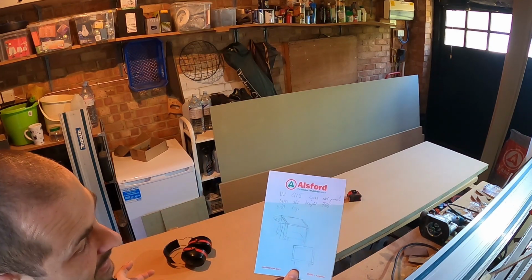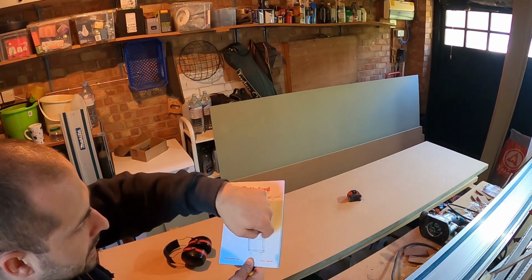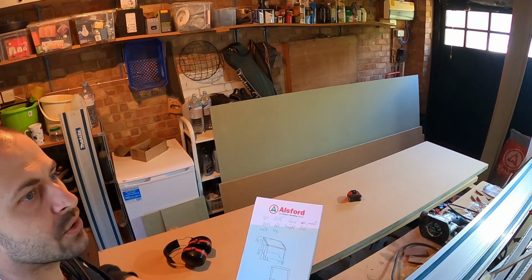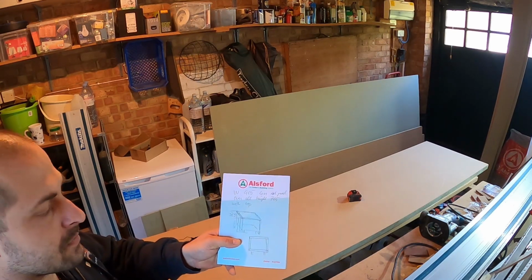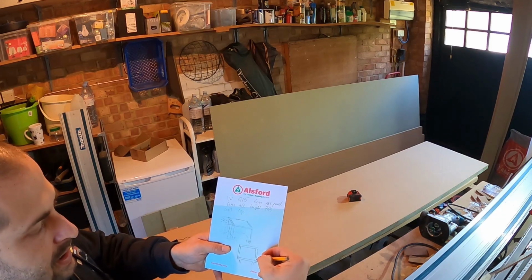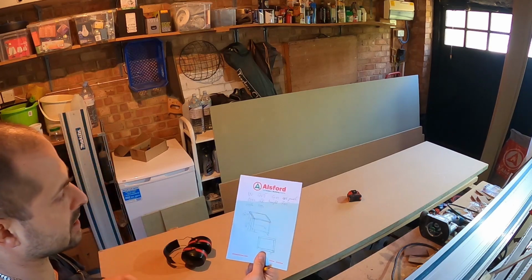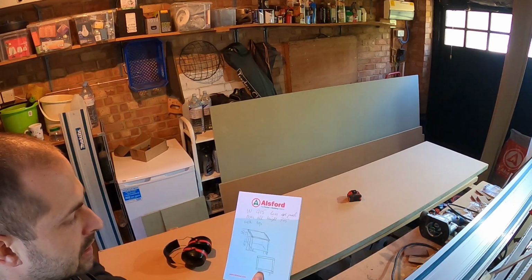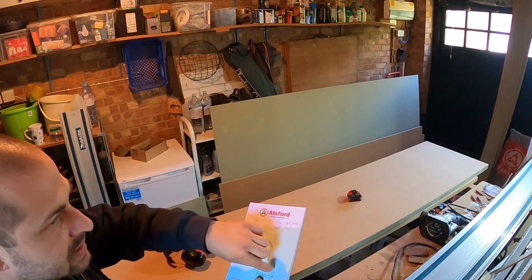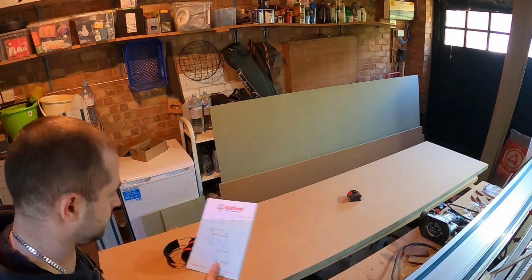Probably IKEA again, most of them do it so the sides are longer and screw in. I do it the opposite. I do it so the bottom piece is one big piece which takes everything. It's like a foundation, if you like. So that's how I do it. And also that allows me to cut as a pair each. So I can cut the length and the sides from this piece.